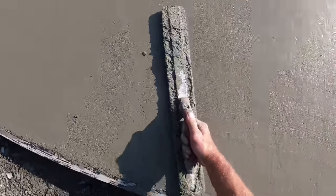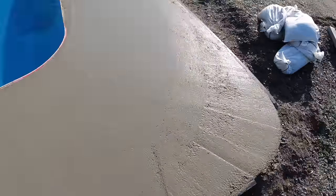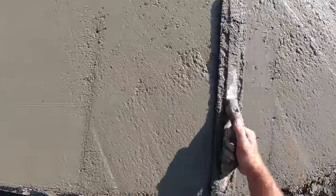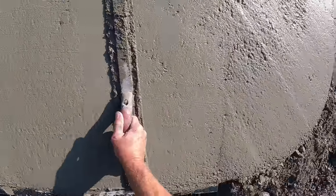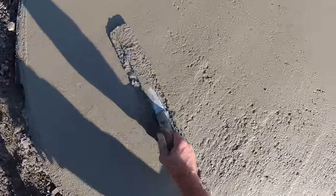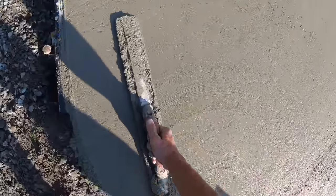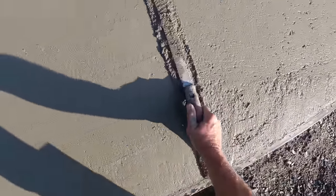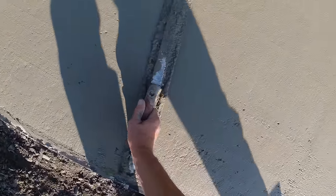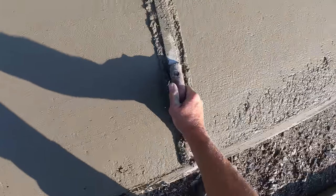First truck out of the plant in the morning sometimes is the hottest truck, because the aggregate sits inside in the bins, and sometimes it'll heat up inside the bins, especially like yesterday was 90 degrees. The nights don't cool off very much, so when they load that first truck and the aggregate's warm, this stuff's gonna set up really fast, so we're gonna be hustling. By the time we get done pouring, we're probably gonna have to go right back on it, get ready to start cutting grooves, stamping.